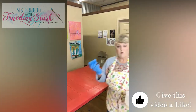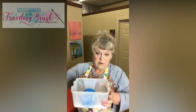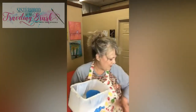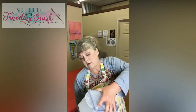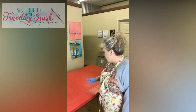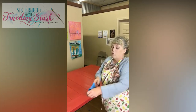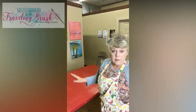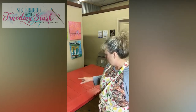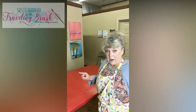I've now gone all the way around it with the Gator Hide and the soft sponge. I'm going to put the sponge down in the container and let it float, then put the lid on to keep it from hardening up, because I'm going to need it again for another coat in a little while. I'm at the point now where I'm deciding whether to use the wax on it and then worry about my next coat of Gator Hide, or whether to create myself a glaze.